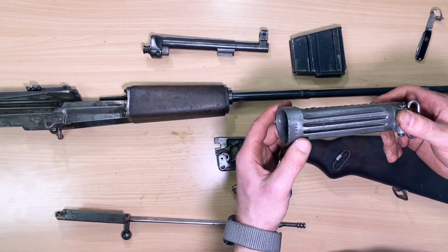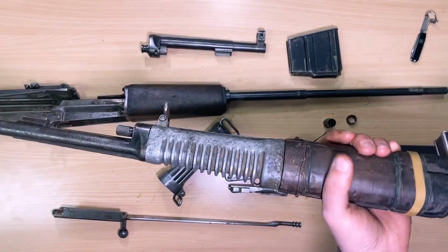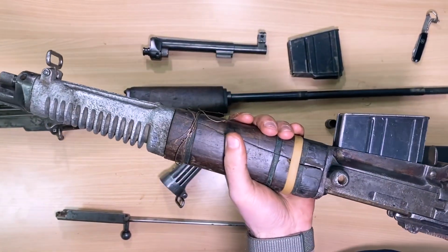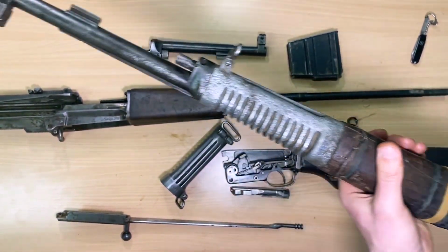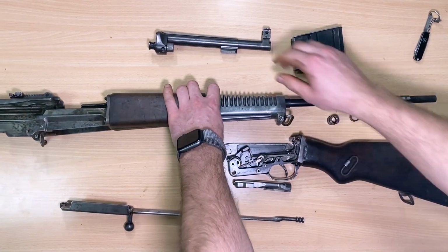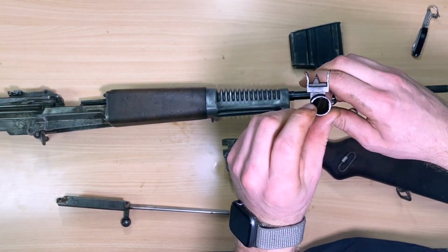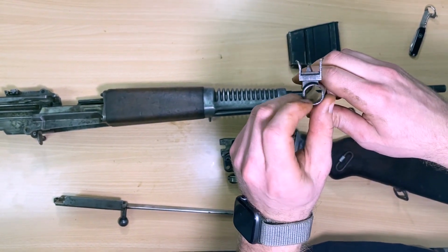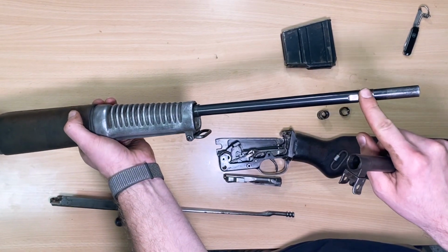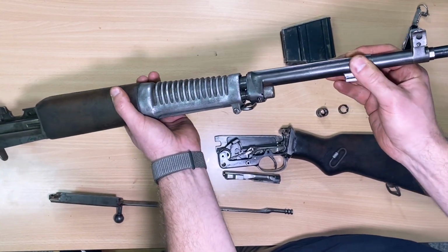So I will start with this aluminum chunk with the number 109, and actually that reminds me that the other one we have here has the number not on the bottom but here on the side, and it's number 107. So maybe they were the first from the contract and the serial numbering started with number 100, who knows. So I put it like there. I put a sleeve there, and the sleeve is secured in the right position by these two flat surfaces on the side, which are placed where the thread is missing, so you can't turn the sleeve around and it's fixed into its position.